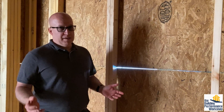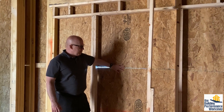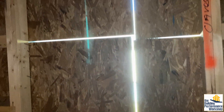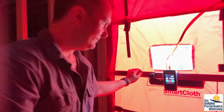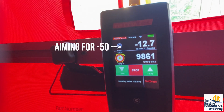One benefit of pandemic supply chain issues is that our windows are 16 weeks out, so we decided to do this experiment: we covered up the openings with OSB, we're going to seal all these joints and coat this as well. When we do this experiment, we're going to do the blower door again with the complete building envelope sealed up, including the openings for the windows. Once the windows arrive we will cut those out and flash around them, but for right now we'll leave the OSB in place. Alright, we're ready to blow.